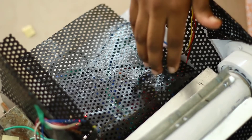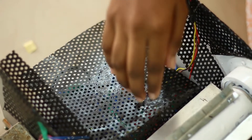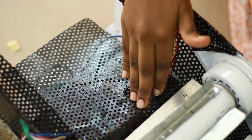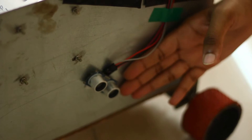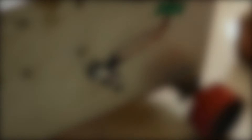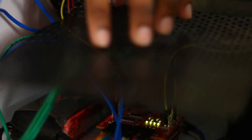Using a blower, the dust particles which are collected along with the mustard seeds are removed. An ultrasonic sensor is fixed along with the tray to check the quantity of seeds. Ultrasonic and IR sensors are used for automatic adjustment of cutting height according to the plant position. The machine mode is automated and controlled with the help of microcontroller Tiva CCS.